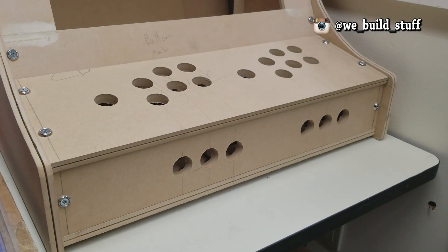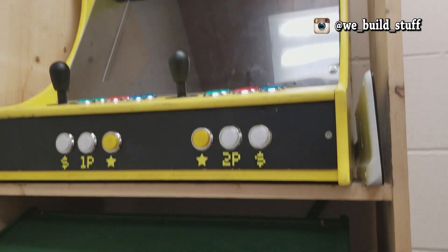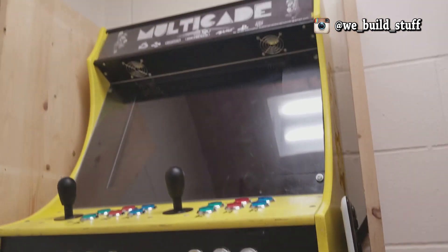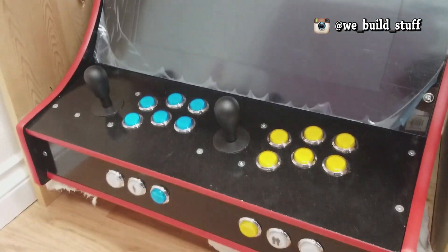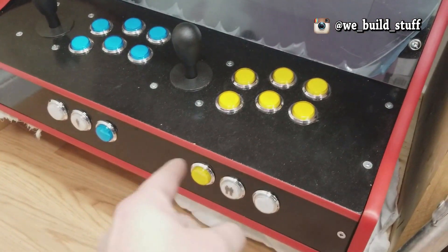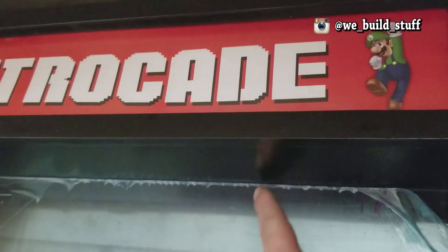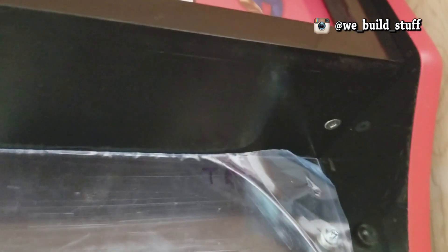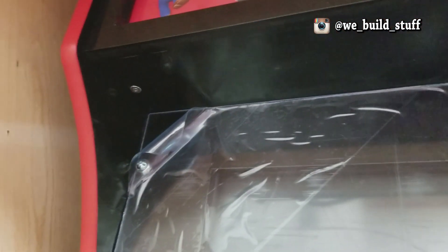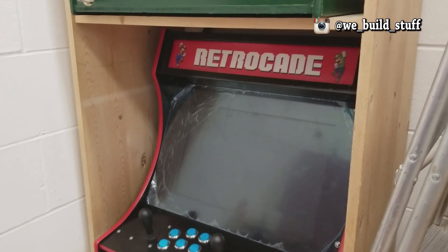This one's almost complete — you might recognize these from the first video. I started with that green one, made a nice yellow one, and my favorite new one is down here. I've added T-molding all the way around, and again that's the half-inch MDF using the simple steps from the video. The marquee is all one piece — actually two pieces glued together — and all held together with those t-nuts behind going into those support blocks. Like and subscribe, please ask me any questions, I do my best to answer all your comments. Cheers!